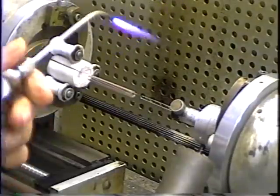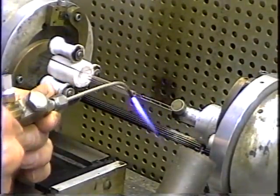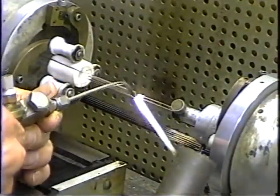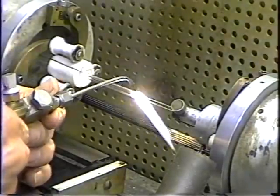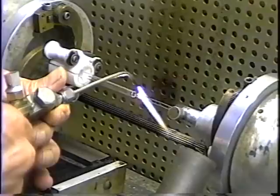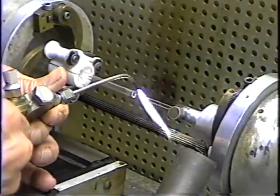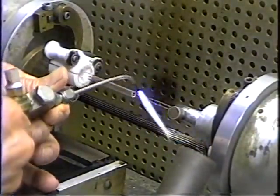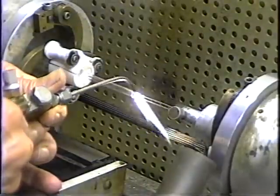I'm just going to use the small tip and go ahead and plate it on there, being very careful not to overheat it and melt our nickel wires. The tungsten wires won't melt with the torch, but the nickel wires and the copper wires will melt quite easily, so we have to be very quick with the torch to just heat up the tungsten. It just has to flare — it doesn't have to be quite hot for periods of time. I'm just going to do this for a few seconds to drive the air out. It doesn't take an awful lot.